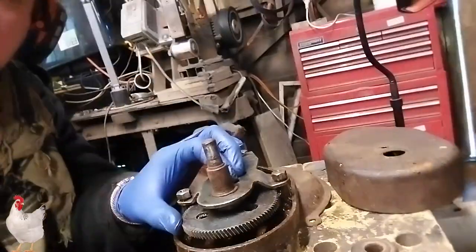A lot of the gunk out of what can be accessed around the tops of the gears and the plate and everything, I'm feeling much more confident about disassembling this further. From what I can tell, it's just going to be a couple of spacers, a couple of bushings, a couple of washers that I have to keep track of. You don't want to lose any of the pieces that can fall out of this. My concern was that some of these, they're a century old, and some of the bushings and things can actually fall apart on you as you pull them apart. Now that I've cleaned out most of the old grease and I can see a bit clearer, I can see that they're all beautifully intact, or seemingly, and so I feel a lot more comfortable pulling this apart further. So let's break this down and get all the parts out and give it a really thorough scrub.